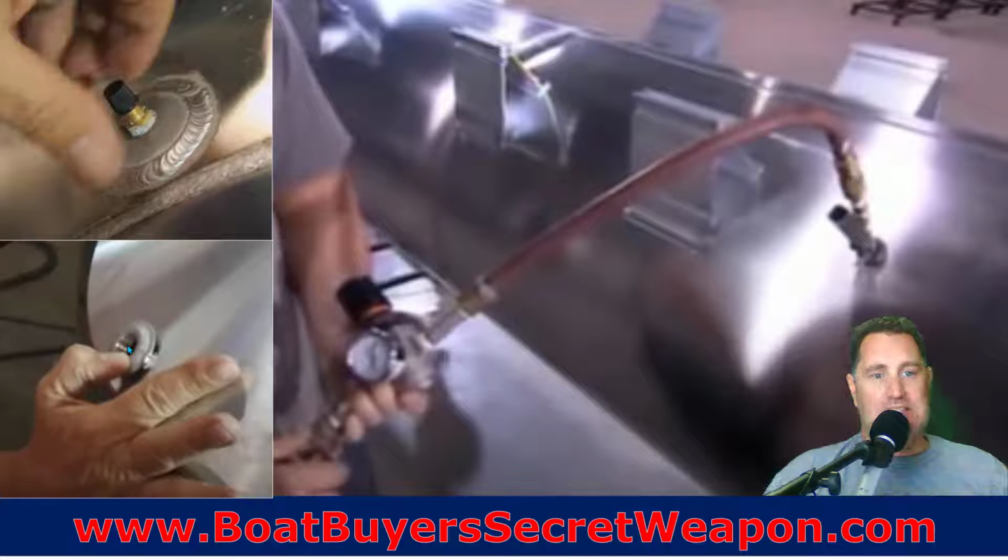Well, if everything is sealed, the only way I'm going to get water in my tubes, if the welds are good, is if I hit a rock, an underwater obstruction, and put a pinhole in my tubes. If that's the case, there's a hole in my tube and we've got to get the water out anyway so we can then drill in. I don't want the source to drain it to be the source for getting water in. It doesn't make sense to me. But they do it for that reason. The air valve, they do it so you can repressurize it, but again, 3 to 5 pounds.